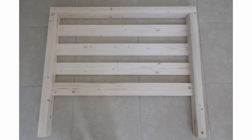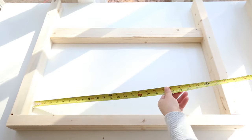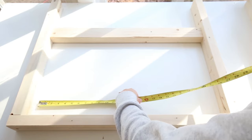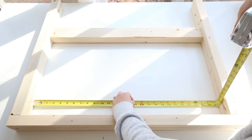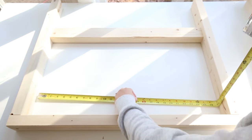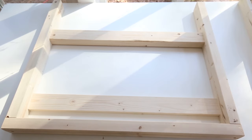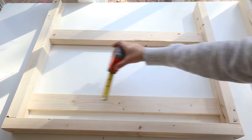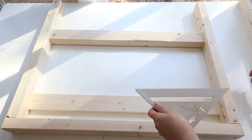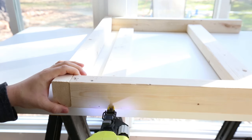Step 4 is to add the side slat boards to your chair side frames. These side slats are really just for decorative purposes and they're totally optional — you don't have to add them for structural reasons. But I think they make the chair look extra cute, and I also think they'll be helpful for keeping pillows from falling out the sides. The measurement should be close to 27¼ inches, but since we're working with framing lumber they might be a tiny bit off, so measure for the exact length. Space the 1x3s 1¾ inches apart starting from the top of the 2x3, and add each 1x3 one at a time with 2-inch brad nails through the side 2x3 legs.